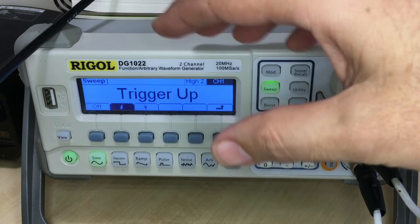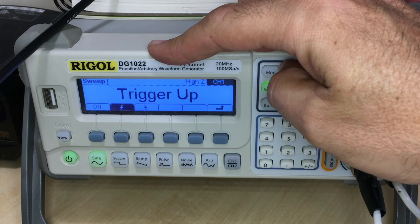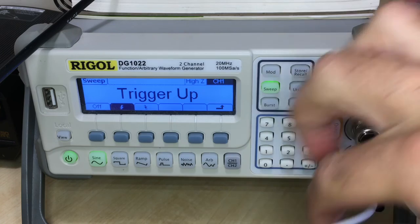That signal is going into my channel 2 of the scope, and the reason it's not going into the external trigger is simply because I want to see it and be able to ascertain and determine exactly that it is triggering at the right spot. Okay, so I'm going in as channel 2 is the external trigger of this thing, and I am triggering the scope on channel 2 as well. So let me show you how I've connected this signal to the radio.